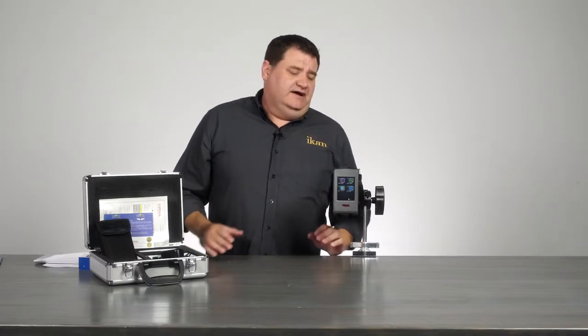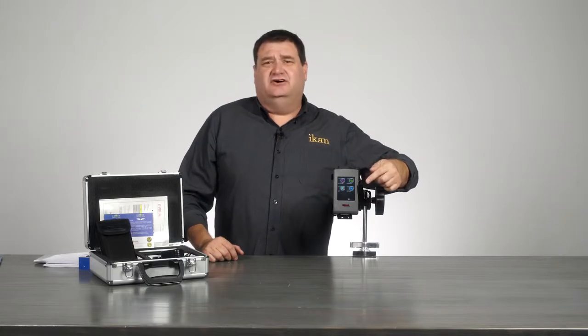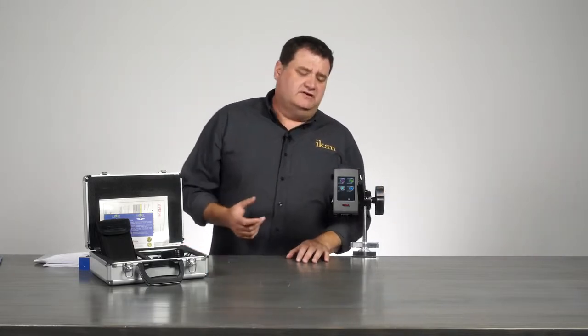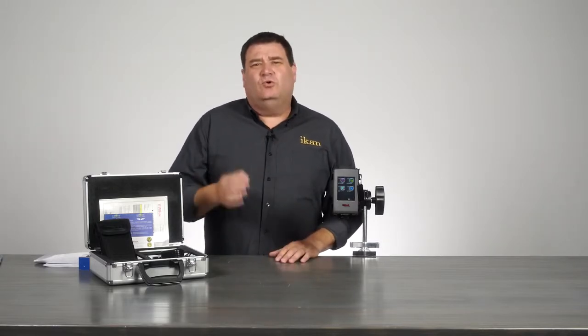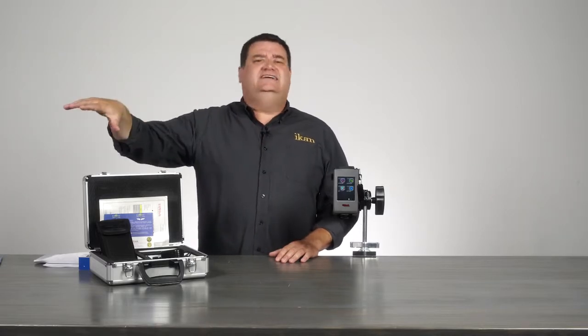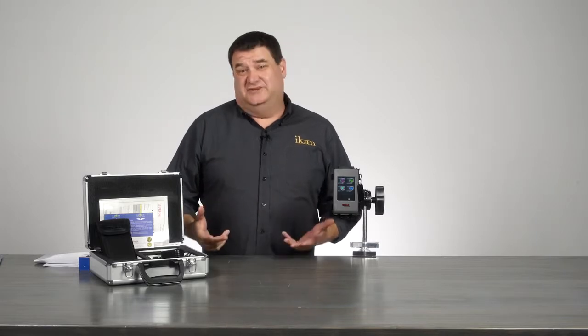The browser allows you to basically control whatever SDHC card you're going to put inside there. Now, the nice thing about the CV600 is that you can insert an SDHC card, class 10 or so, and you can actually record the readings that you're doing. So if you're taking readings of multiple lights on set, you can record those readings and go back and look if you need to do a little research.